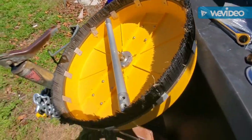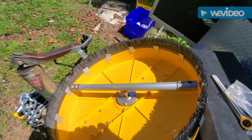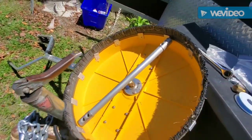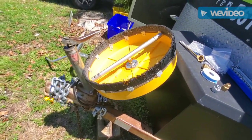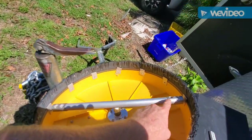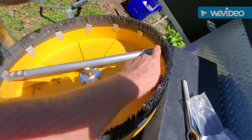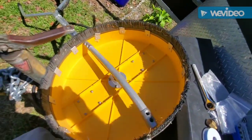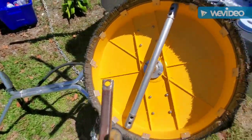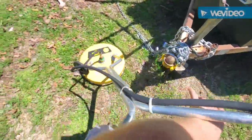Before I put all four tips in all the way, I'm going to clean it out really well with the pressure washer to rinse all the debris out. But this is definitely the best starting surface cleaner to get. When you have a four gallon per minute machine, put plugs in two slots — they do sell a two-tip bar, but I like the four-tip bar. I bought it with a four GPM machine, plugged the two inside holes, put 2502s in the outer two, and when I upgraded to my 8.5 GPM I was able to use all four tips. Right now I'm going to 2503s. The Whisper Wash Classic is definitely the way to go when you're starting out. Alright, take care guys.